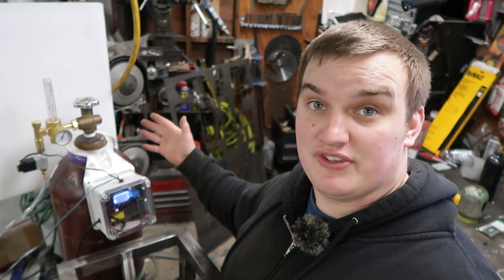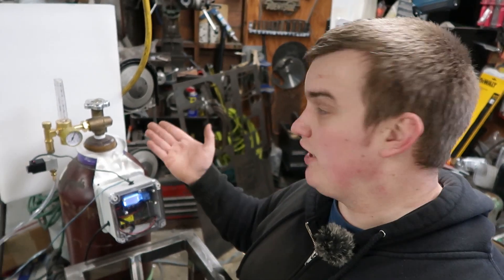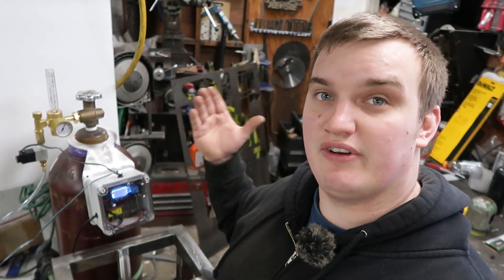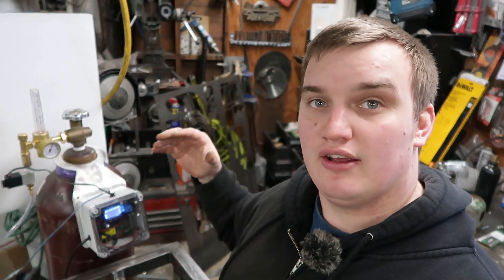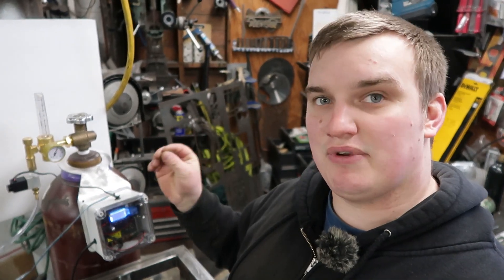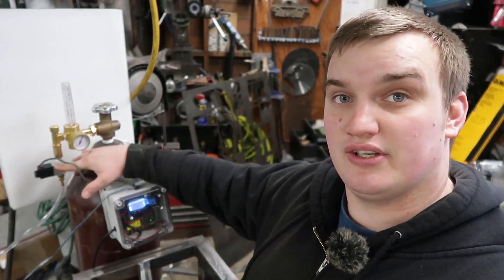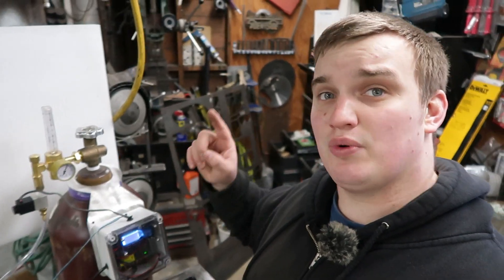Overall I think it was a real success, it's going to be a super helpful tool. There were a couple of hiccups along the way. One of the biggest ones was that argon regulators have different thread types — this one is a CGA thread and I couldn't find anything in town that would fit that. So I had to take the quarter-inch factory nipple off, machine it, and tap it to a quarter-inch NPT so that I could fit my electric solenoid. That ended up working great.